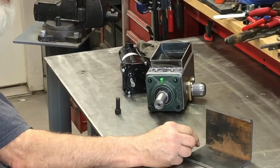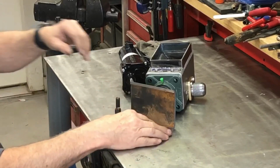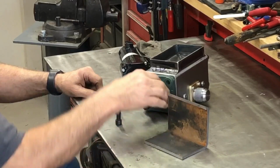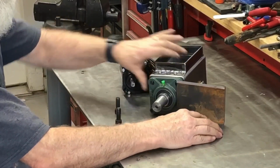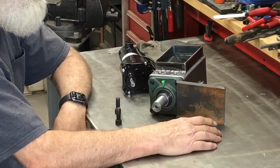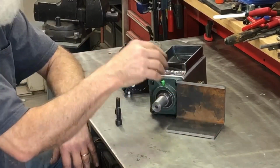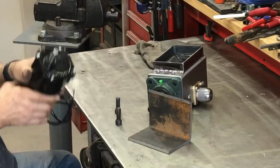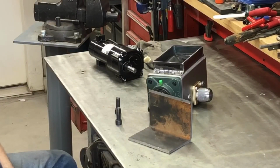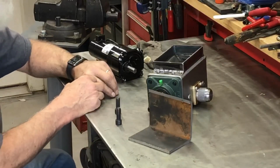That's because I knew there was going to be an extra 1/4" right here. So when I'm done, I'm going to make a pattern that goes around these holes all the way out, so this whole hub will just go up flush against this boss on this pillow block and hold this piece of steel that I can use to mount this guy on. That's the plan anyway. So yeah, phase 3 or 4 or whatever of this project.